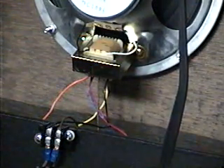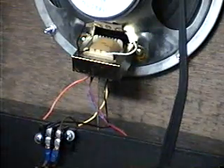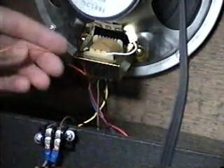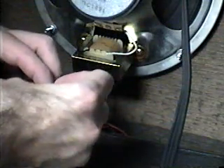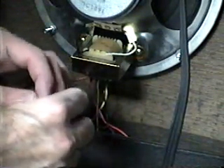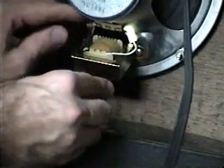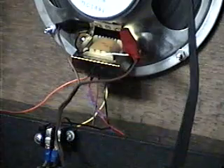That's going through the 10-watt tap of the transformer, and that puzzles me because if the stereo is 30 watts it should be louder. Now I'm going to try this orange wire — for this particular transformer that's the 5-watt tap — and it's about the same volume. So what I end up doing for this kind of setup is hooking it directly to the speaker itself. And as you can see, it's a lot louder — that's why I'm wondering why that happens.